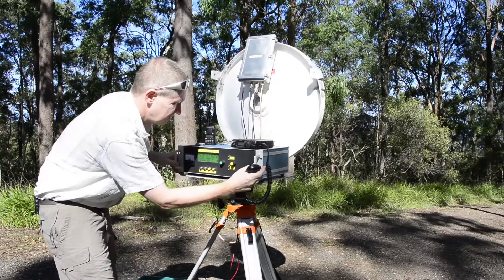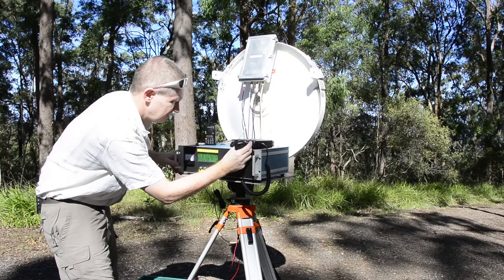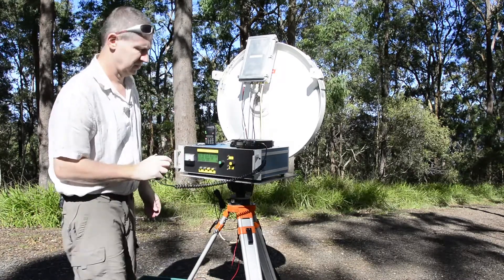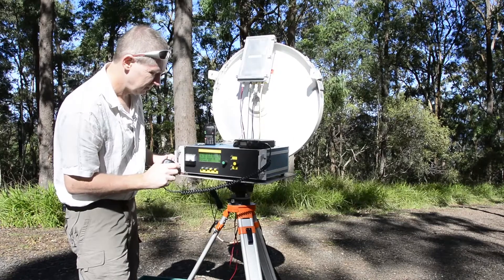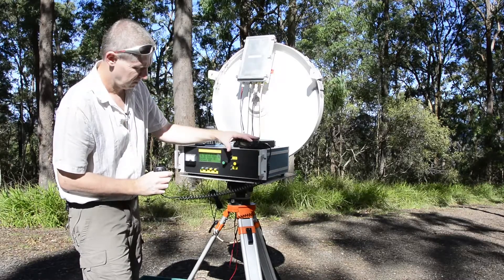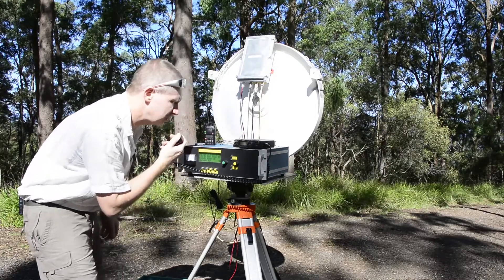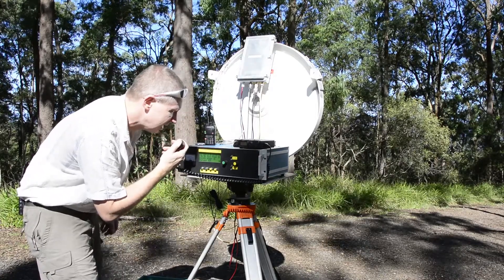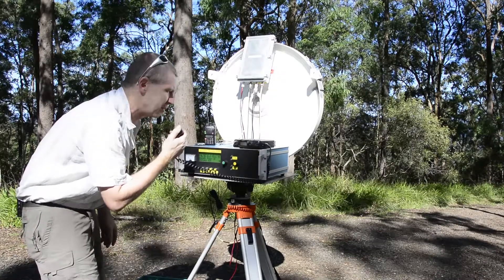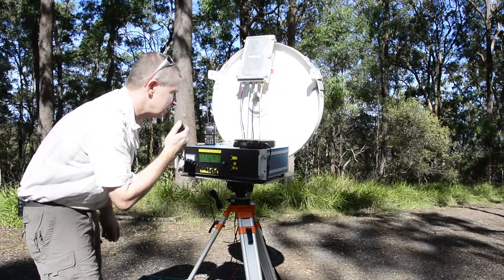Just looking at a couple of micro-helicopters or gyrocopters or something flowing over here — you might see them heading right over the top of the house. I think apples for apples I'm in pretty much the same position as last time, 50 metres or so. VK4WR, VK4GHZ portable on 10368.150. Dial on the 817 is reading 0.75, so it's 250 hertz off somewhere — probably a bit at both ends. I'm not GPS-locked on the 817; I've never found that to be necessary, but it's so close it doesn't matter. Over.